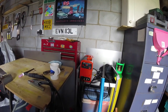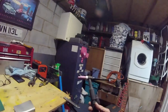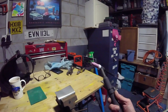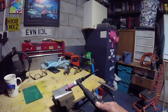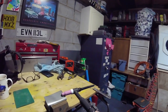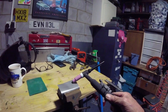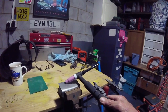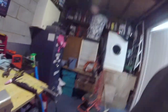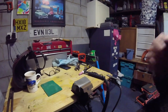I've just ground the tip on the tungsten and stuck it in. I'm ready to fire up and do a first strike of the arc. This welder has high frequency so I shouldn't need to touch it on the steel — if I do, I'll have to regrind it. What I'm aiming to do is strike an arc and probably just drag it along the steel to see if I can keep the arc going for a little way. Like I say, never done it before. I've got my arms covered, got my old jeans on just in case. I'm sitting down on my swivel chair with the piece in a little vice, so I should be comfortable.